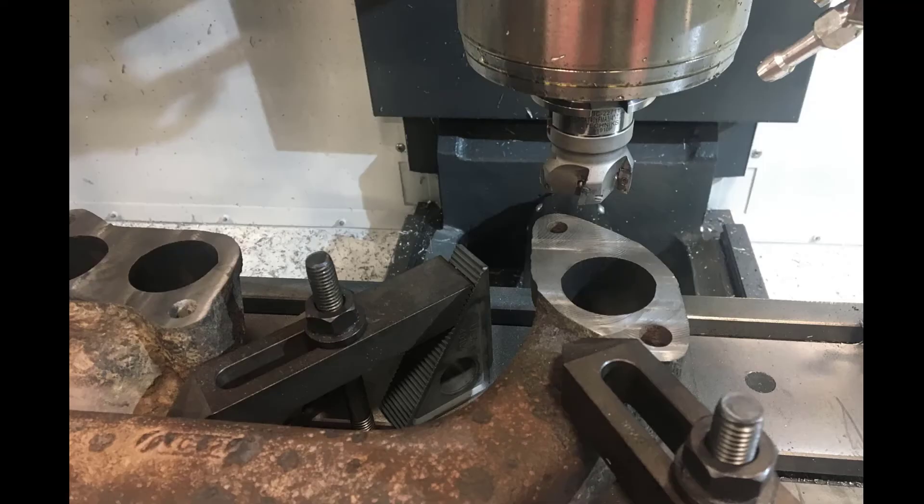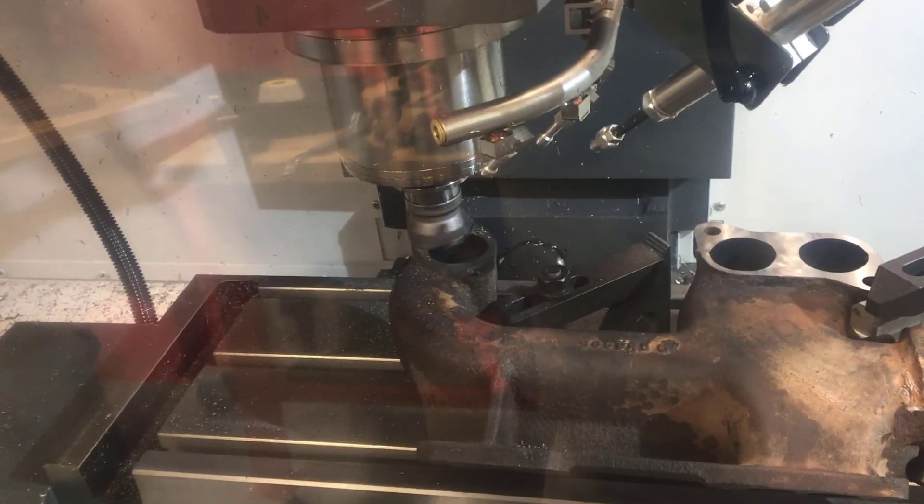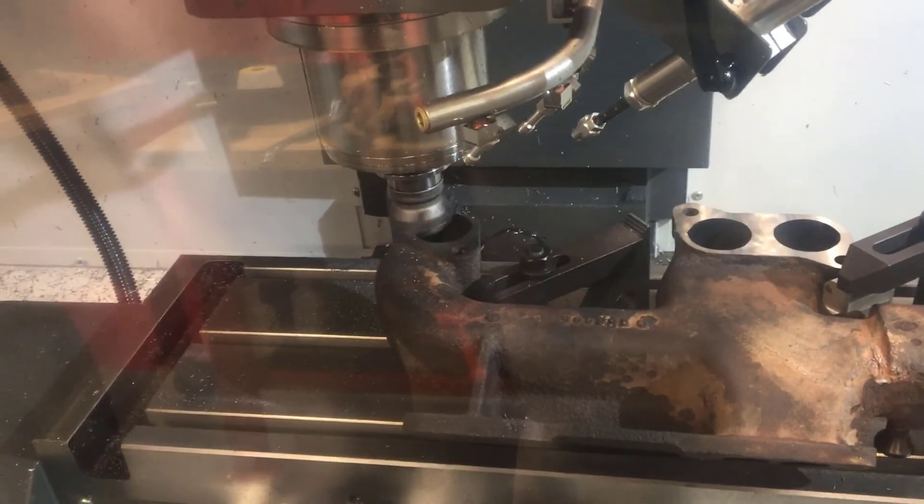Once the other side was parallel to the flange surface, it was a pretty straightforward setup and machined easily. I started with about a 30 thou pass thinking that would clean it up, but the more damaged area ended up needing about a sixteenth of an inch of material removed to clean up the entire manifold. End result on the surface plate: I couldn't get a 3 thou shim underneath, so it's within 3 thou flatness — plenty good for this application. I hand-jogged the whole thing; wasn't worth writing a program. Pretty free-cutting inserts, easy setup, didn't take very long.